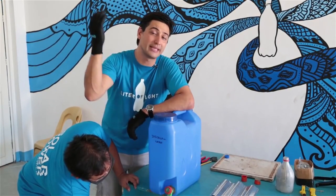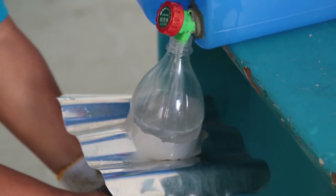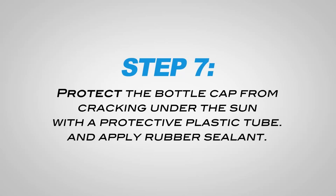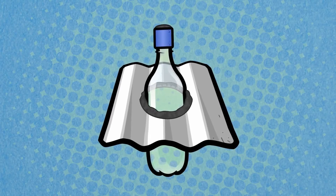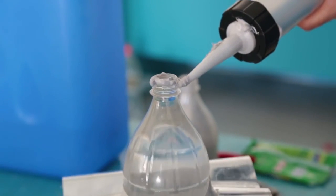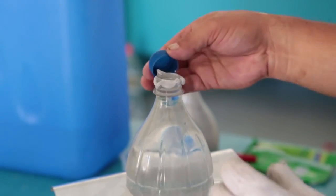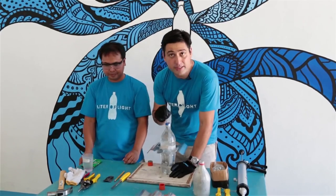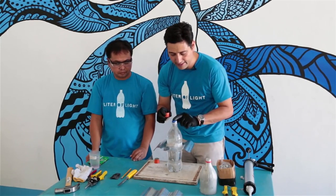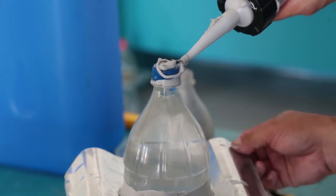We're trying to get as clear as possible light from outside to go into the house. Fill up the bottle all the way to the top so that there is no room for evaporation. It's very important to put a sealant in the bottle cap so that no evaporation goes out from your solar bottle light. This bottle cap cracks under the sun, so you need to protect it by putting a sheath around it to make sure the sun's rays do not crack the top of the bottle. This is the most important part of the solar bulb, so you must protect it with a sheath.